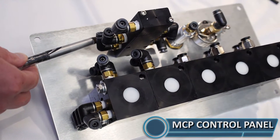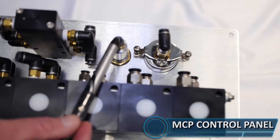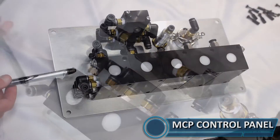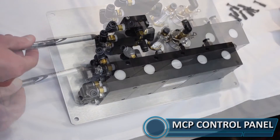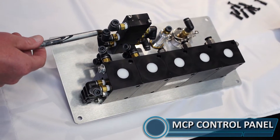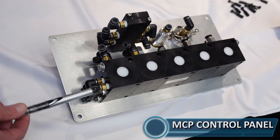When that air goes up to your vapor vents, it goes through all your vapor vents and returns back, coming into your pop-up indicator, and it also goes to port number one on the side of the manifold. All the ports on the side of this block are labeled. The other port on this side is port number two, which is this middle port right here.